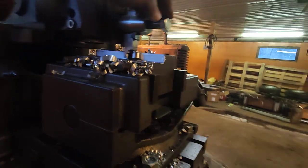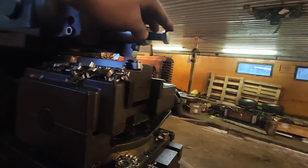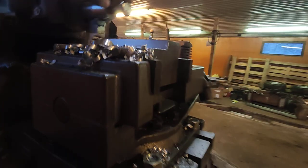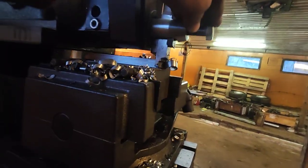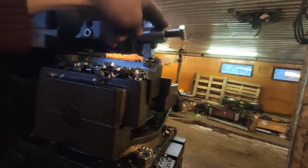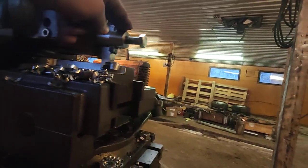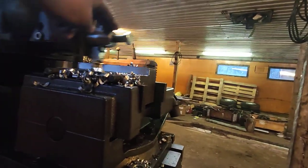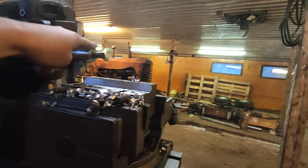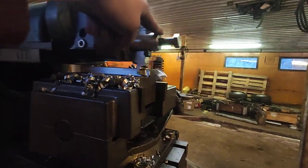The reason why this is cutting double chips is because the tool has a double grind. I originally had the tool only 13mm deep, and I figured that's not enough for me anymore, so I started to grind it deeper. But then I thought, why grind it all the way back — it will work just as well. If I make a two-step tool it will only make double chips, but it's not the chips we're making, it's the part. And not even a part in this case — we are just having fun.